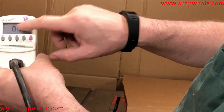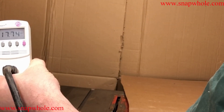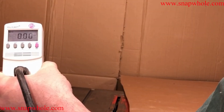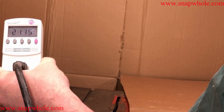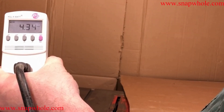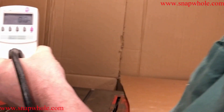So we've got it on amps — let's see the current draw. It flashed to 17 amps and then went to 5 amps. It peaked at 21 amps, and that's on a 20-amp breaker. So it's at 21 and it's not tripping the breaker. Let's see how many watts it is.